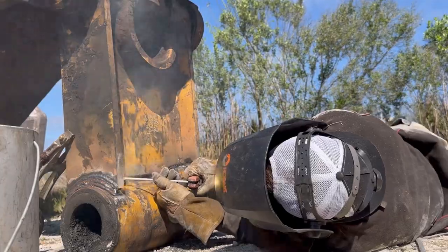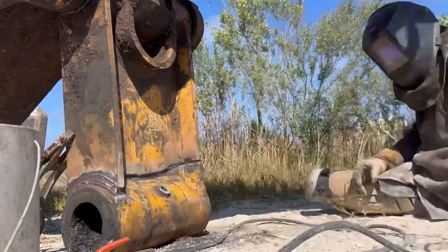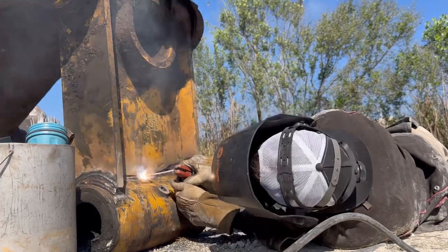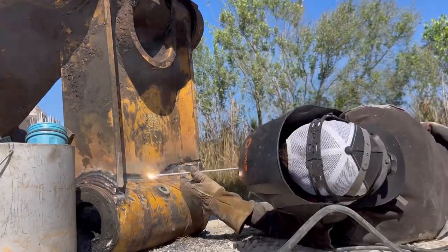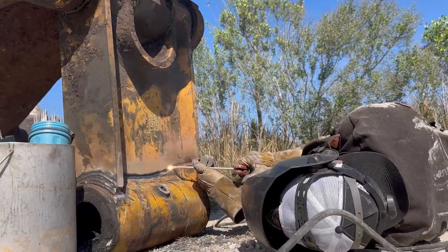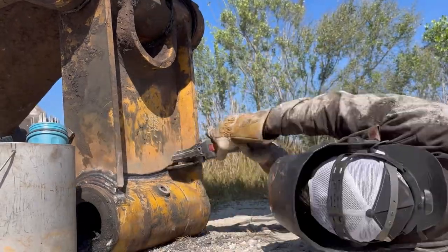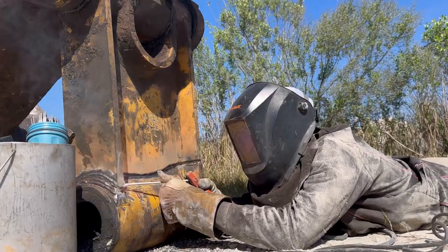I'm running at 125 amps right here. The first couple of passes come out pretty good, but I think to myself this could use a little more. So I hop up right about here and change my amperage to 135. I changed the OCV a little bit too — I gave it a little more dig. And it's starting to turn out really good right here. I'm running my weld in this direction because obviously I'm going uphill, and whenever I'm running a low hydrogen rod like 7018, I always run it uphill.